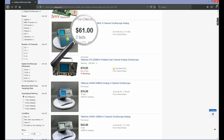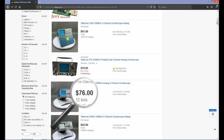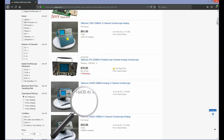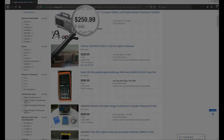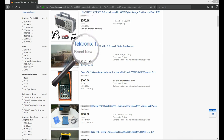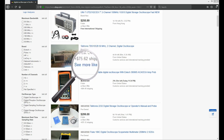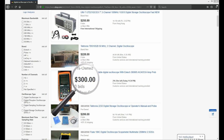But obviously an old analog scope doesn't provide the convenience of automatic waveform measurements and screen capture, etc., like digital storage oscilloscopes provide. But even cheap digital scopes, which means limited bandwidth, poor quality or both, start at several hundred dollars. So what would you need to do to convert a cheaply available analog scope into a DSO without spending too much time, effort and money, which otherwise means you could just go and buy one?